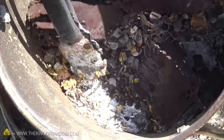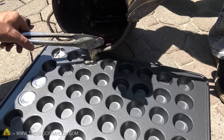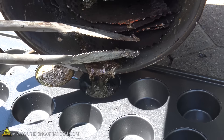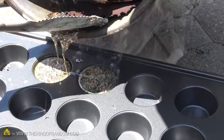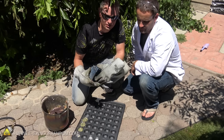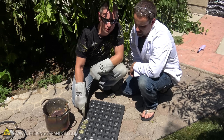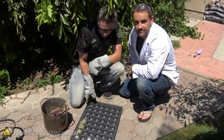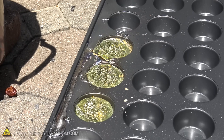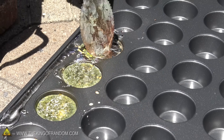Feels like we're getting more. That looks a little bit dirty — looks like there's more than just lead in there. So we did get some pure lead ingots near the beginning of our melt, but as it progressed I think this got so hot we mixed in some other metal alloys. These are still so raging hot right now — if I jiggle this pan you can see it's actually still in liquid form. We just have some impurities on the top, and we get rid of that and then we've got some nice lead ingots.